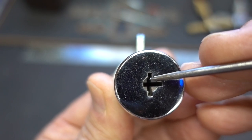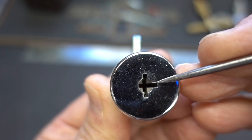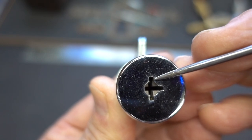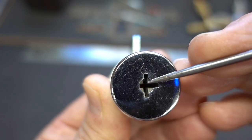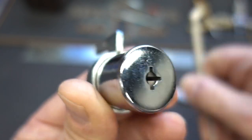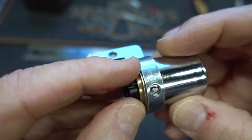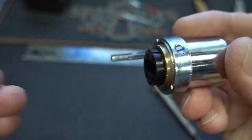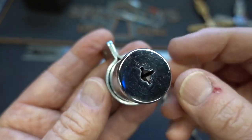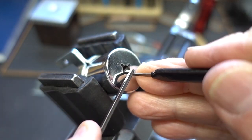And then we can rotate it. When I pick it — or if I pick it — I'm probably not going to rotate it the full 90 degrees. I don't want all the pins to pop back into place, because then the key won't go back in and I'd have to pick it again just to relock it. I'm going to pick it, show you that it's open, then relock it in the original position. There's a little screw here — if I pull that out, we can probably slide the whole housing straight out of the armored cover and look at the guts. Anyway, let's see if we can just get it picked.